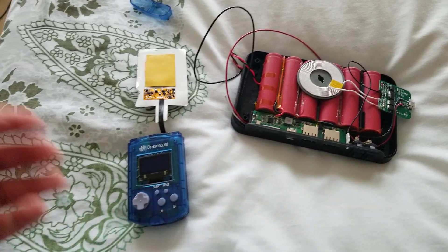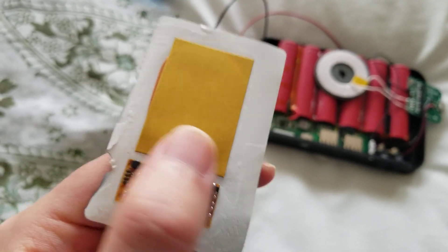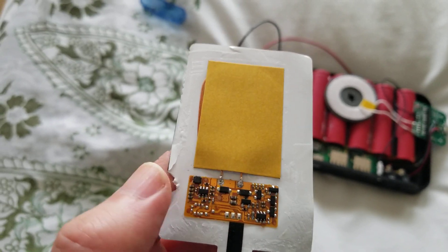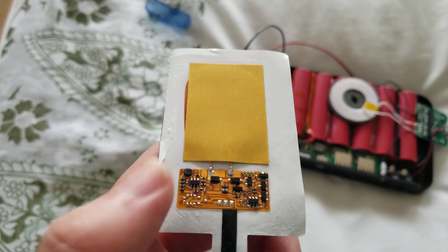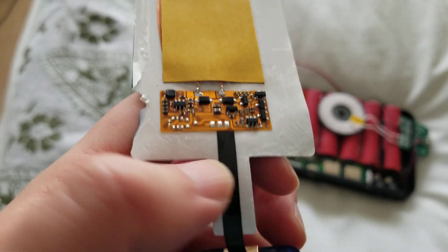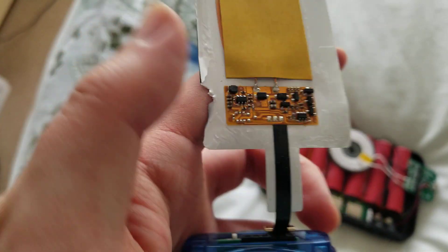For now I just wanted to make a really quick video. If you look, basically it's a coil, and this little sticker part stuck on top is actually a very thin ferrite sheet that it uses to concentrate the magnetism around the coil. It's on a standard micro USB on a flat flex ribbon.